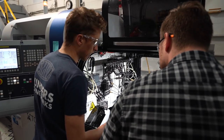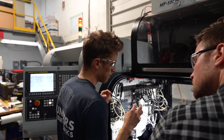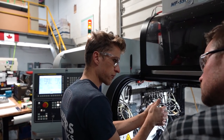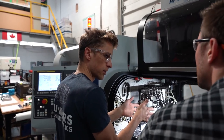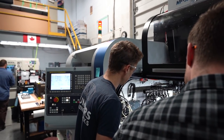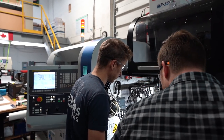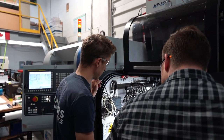And so sometimes you gotta manage your operations so that you do the front of the part first and finish the front of the part and then move it out a little bit and then do a little bit more. So you gotta be careful like that. But it's cool because you can stage it and the machine's so repeatable, usually anything blends together really well.